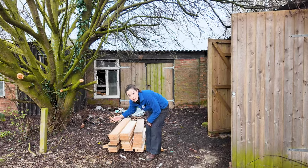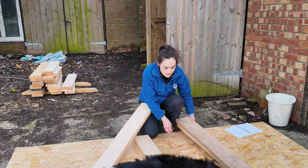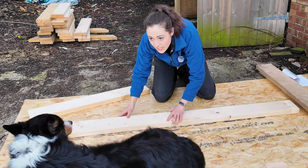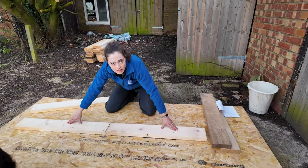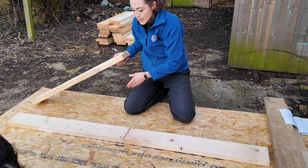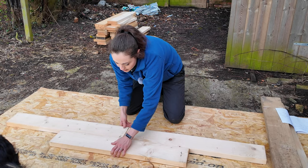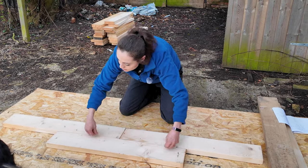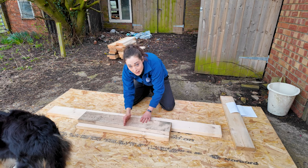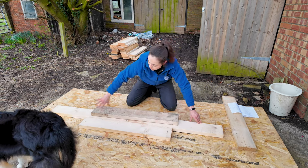Because I've only got so many of the longest lengths for the short ends, I can get five raised beds out of this. To make sure we're on the same page, I'll show you what I need to do. I'm having a running bond — that's the length of my raised beds, which is a nice manageable length. I'll put one stacked above for the running bond and I'll be screwing them on an angle. I need to cut a longer piece smack bang in the middle, and with those two cuts I can put one on each end and have one long piece that matches.